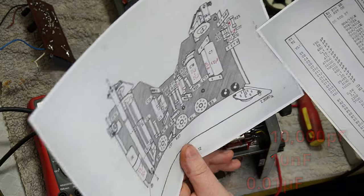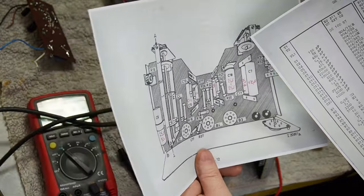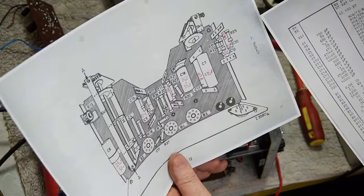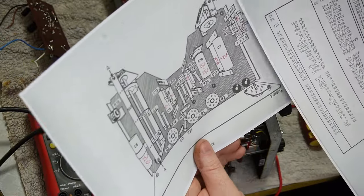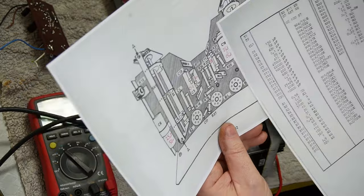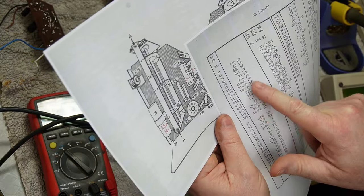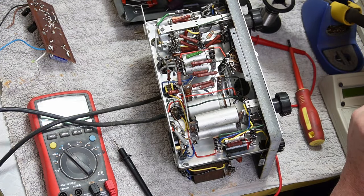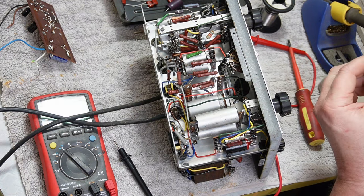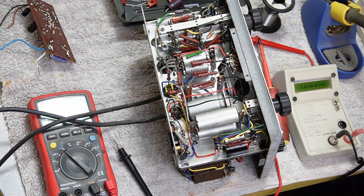And the bottom one is one of those big fat black Phillips ones, although it seems slightly nicer than the ones you see in their radios. Supposedly 47 nanofarad, that is C10, has 47,000 picofarads, which is 47 nanofarads. So 0.05s, I think these big ones are the 0.05s. These were the ones that I got sent. I did a reorder.